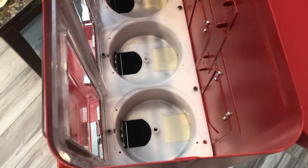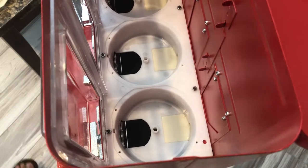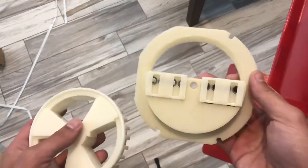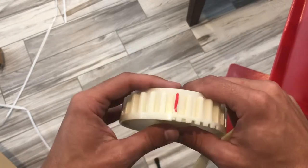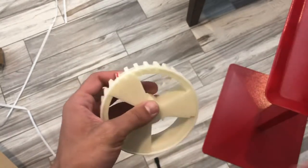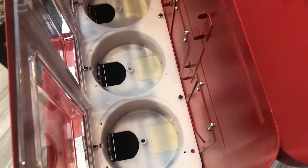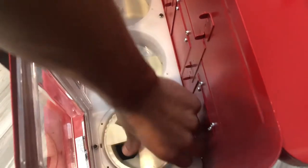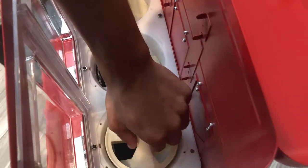You are given three mechanisms. Typically it is two candy and one gumball mechanism. We're going to start with a candy mechanism. Your candy mechanism comes in three pieces. This is your adjustment, depending on what type of candy that you have. It will come with the tooth on this red line marked here. Depending on the type of candy, you'll have to read your manual on how to adjust it, but it's pretty straightforward — you simply rotate that piece to allow more or less candy. For demonstration purposes, I'm going to leave it in the stationary spot, and you are going to want to put this down with the adjustment side up so it will be easy to adjust once installed.